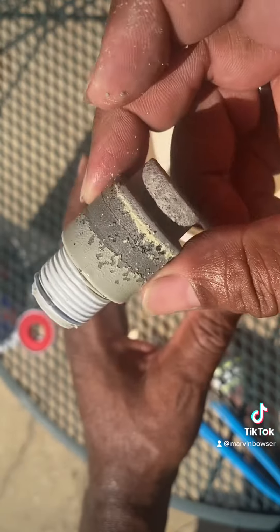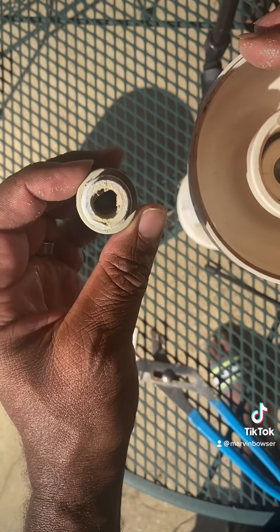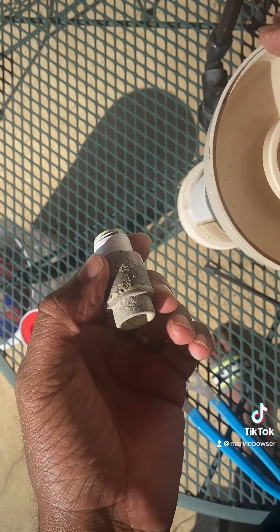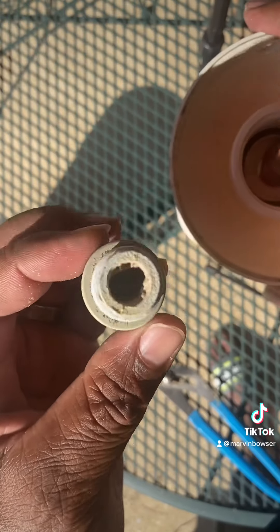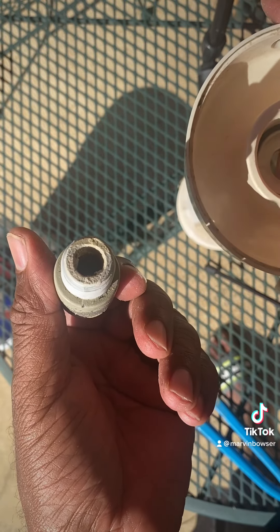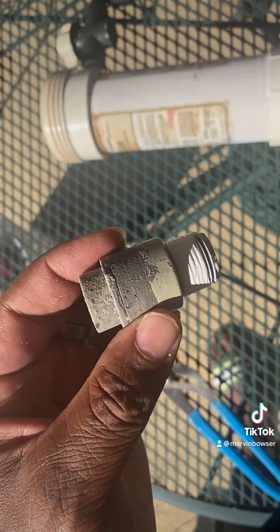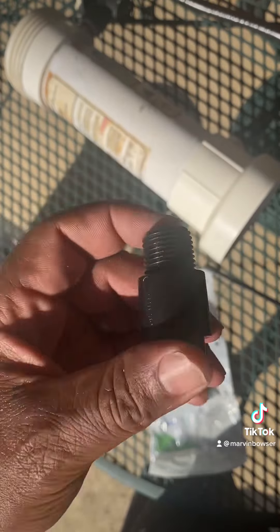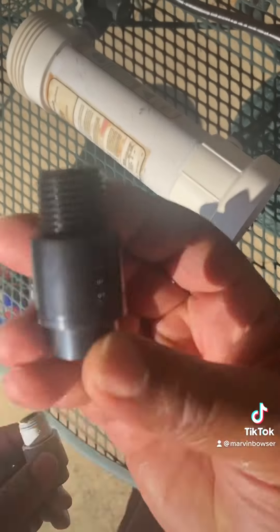There's no o-ring for this piece specifically — it's just plumber's tape. And the shake test — no rattle — means the check valve is not checking anything; it's just stuck. The replacement piece runs somewhere between $12 and $15 on Amazon. There are supposedly ways to open the old one and get it to work, but at $12 to $14 you can just replace it with hardly any tools in a few minutes. New piece: rattle. Old piece: no rattle. So the old one doesn't work, and this new one should work like a champ.